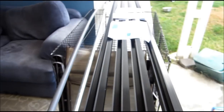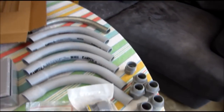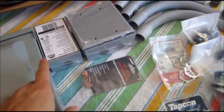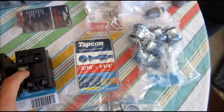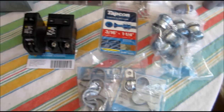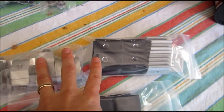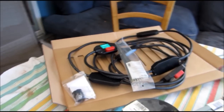Then you've got to buy all your hardware. These are my rails — 10-footers for a six-panel install. I've got a 10-foot piece of EMT conduit for the roof, some PVC for the run down the side to my main panel, all my conduit fittings, strain reliefs, and the junction boxes. You'll need an AC disconnect and breakers — I got a split breaker for extra room. I've got concrete screws for mounting conduit, 10-gauge wire, lag bolts, bus cable from the inverter company. I'm using Enphase microinverters — six of them. I've got the six panels in the garage and the flashing ready to install.